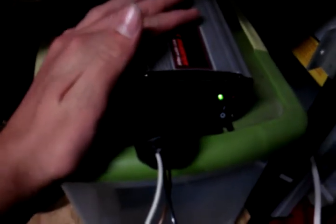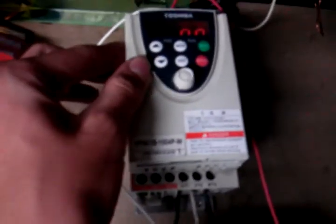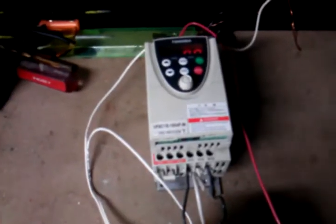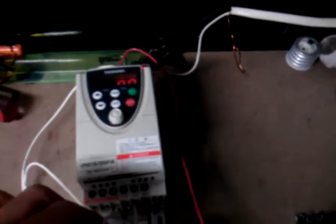All the voltage changes we're doing here: 12 volts to about 110 volts, give or take, at 60 hertz, modified sine wave, coming out here going into the VFD, taking it in as 120 volts modified sine wave, and then changing it to about 370 volts DC, and then switching that into a 240 volt AC three-phase — actually a pulse width modulated signal — into the contactor.